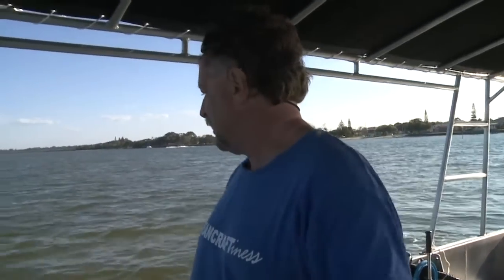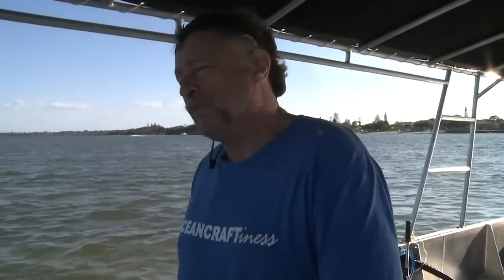It's the deepest V production monohull in the world, and this is official now. At 30 degrees, it's actually on a monohull. That's unheard of. Basically, the way we do that is, of course, we cheat. It's a trimaran at rest. As the boat's making way, the sponsons or tubes lift up out of the water, and all the energy from the wake is recycled. So basically, the boat's got nowhere else to go but up.